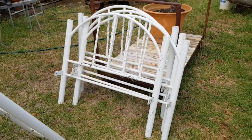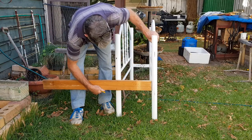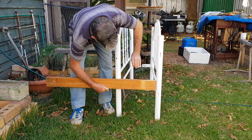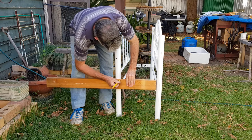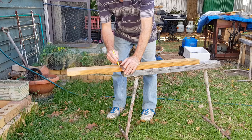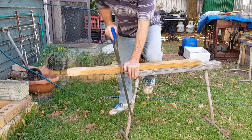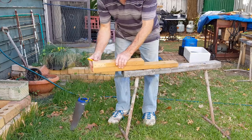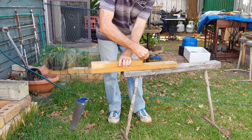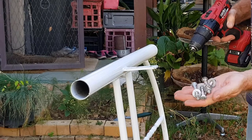First thing is we've got to roughly work out what width seat we're going to have. I'm using a rail from an old pallet here as the support, and I'm just going to bolt the ends together on those metal tangs that supported the mattress base. I'm just marking the length here and scribing it nice and neat. You have to make sure the ends of these pallet rails are square because they're not cut particularly neatly sometimes. I'm marking the other one off this one so they're both the same length, and that will give me the two stays that hold the pipe assemblies together.